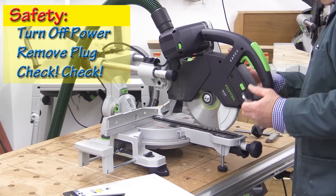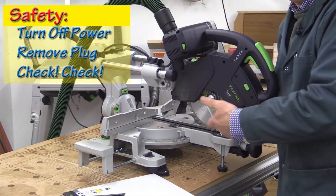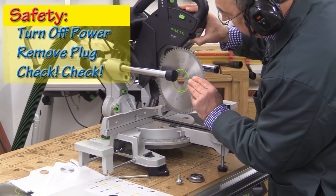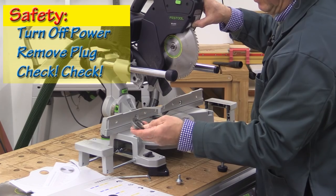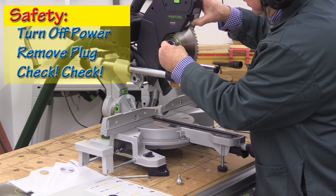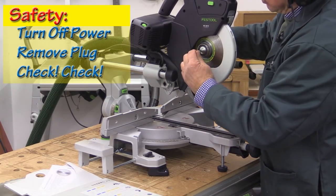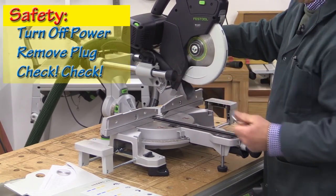Here's the spindle lock on this side. I've got my finger on that locking mechanism. Remember, it's a left-hand thread. In goes the new blade. Note that the writing and the colours are on the outside. Once that's in place, look at this locking washer — it's got a couple of flats on it which match the shaft. That goes on, and then the screw goes back in. You'll feel the shaft lock button go in when it finds one of the locking positions, just like you have on a router or other similar tools. So that's nice and tight.